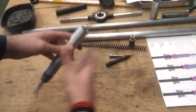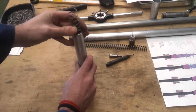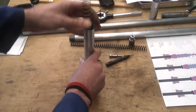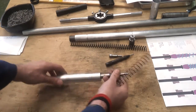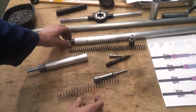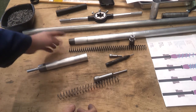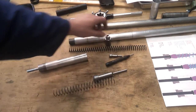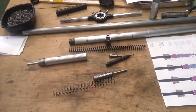It does at least wiggle inside the barrel quite well, and with the spring placed on it and held down we do have a reasonable amount of plunger force. That's just the return spring, so by the time we've added the main spring it should be quite powerful. Next stage will be to cut this coupler, bore out the inside, then chop the springs down, drop the anvil in, assemble it, and see how well it works.